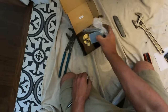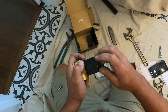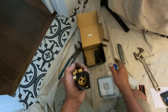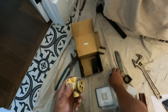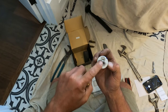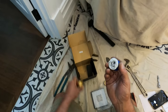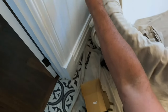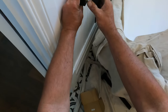All right, here we go — there's the replacement or donor mixer body. There's your cartridge. All of these plates, these brass bodies, they're going to be pretty much the same arrangement for the cartridge anyway. So your cartridge seals there — that's the mating face here that seals all of the water. In theory, we can put the existing wall one in the bin and drop this in there instead of the chrome one, and our handle and everything will mount onto it.